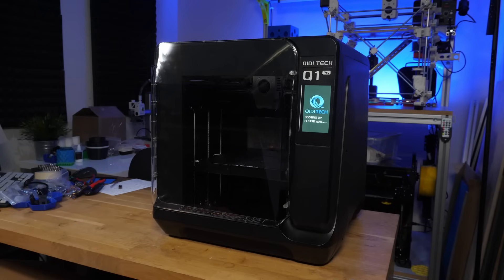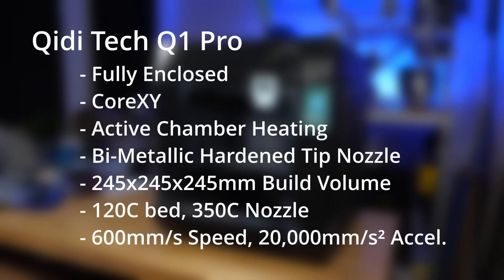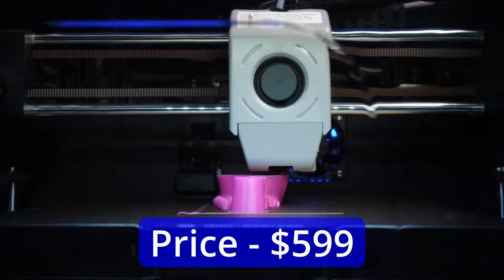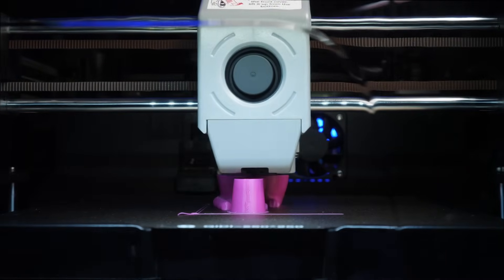I've not been paid, but it's technically still sponsored since they've sent me the printer. The Q1 Pro is a fully enclosed Core X-Y FDM printer with active chamber heating, a bimetallic hardened tip nozzle, and a 245×245×245mm build volume that can heat up to 120°C on the bed and 350°C on the nozzle. They claim up to 600mm/s speed and 20,000mm/s² acceleration — quite a lot to promise for the $599 US price tag. So let's find out if they've managed it.